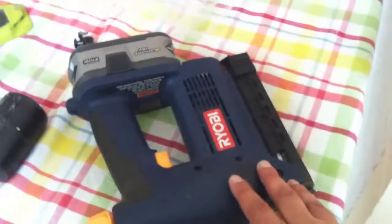In this part I use a power stapler instead of little hammer nails or screws or whatever they give on these things, because it's just the best way to deal with these cardboard backs on the Ikea furniture. The backs come in two pieces that fold out, so they're going to look like this and you're going to wonder what's going on. Well, when you fold them out, they have that wood grain, okay?